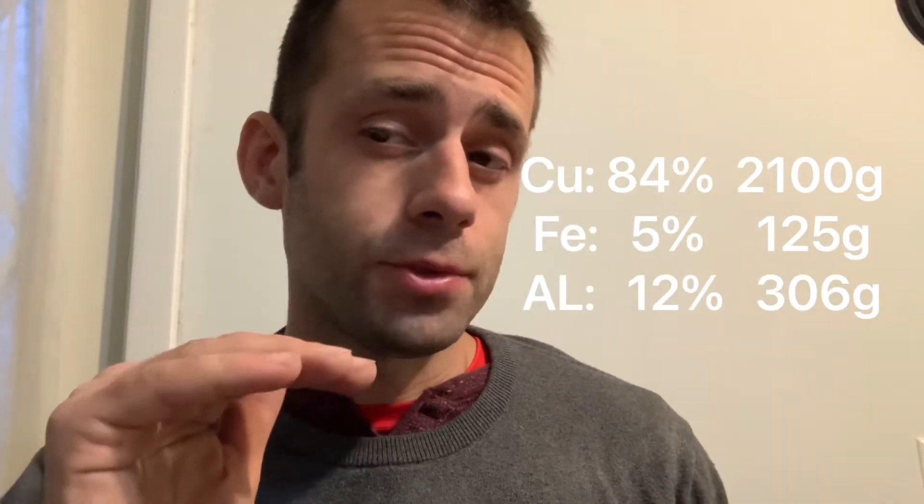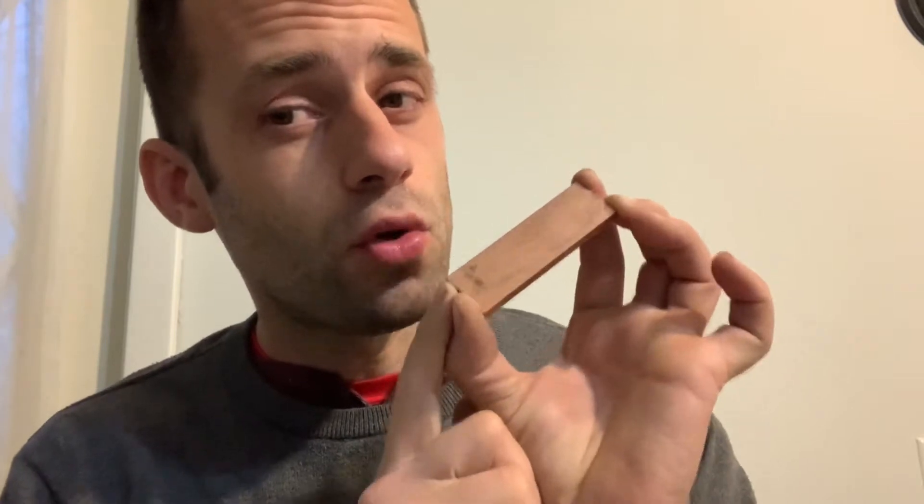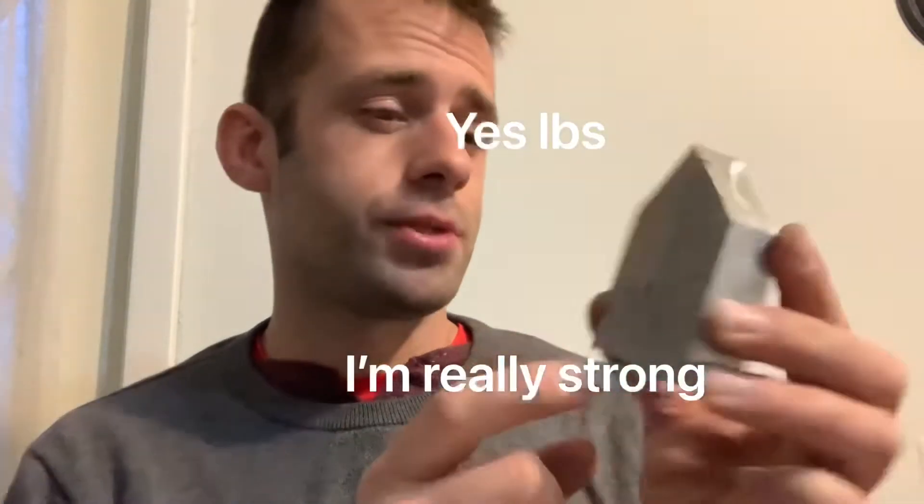For my total metal weight I'm shooting for 2,500 grams — yes, I'm using metric, it's easier. I have weighed out about 2,100 grams of copper, that's 84 percent, and 125 grams of cast iron for about 5 percent. This aluminum chunk is about 306 grams. It's 2024 aluminum so I know there's a little bit of copper in there — I'm estimating about 5 percent copper, though I really don't know if that's close. I've been told that some of the aluminum will oxidize so I'm overestimating the aluminum so it hopefully comes down to about the right ratio. According to what I've read I need about 8 to 12 percent aluminum in the alloy for it to be heat treatable, so I'm hoping this drops down to about 11–12 percent aluminum when all is said and done.